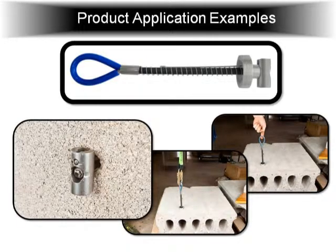Here's the toggle lock — a picture of it, a little better. You can see right here, this is a concrete substrate. Here's the socket and here's the ball inside it — you can see that this can spin around and that can turn within each other. Here's the application where you see the unit is placed in this precast hollow core slab, and it locks in right here.